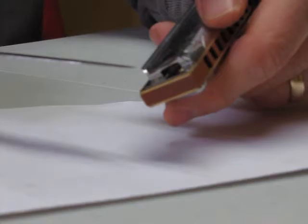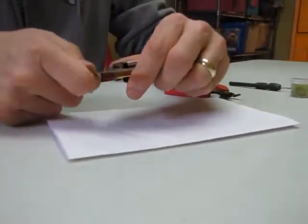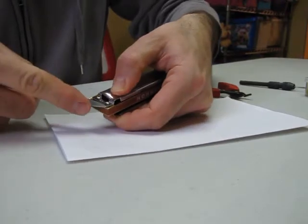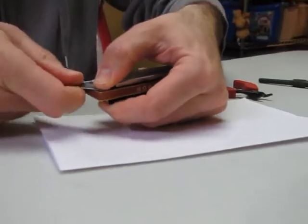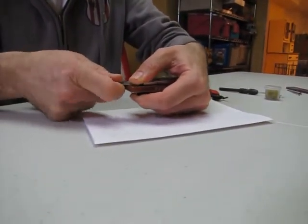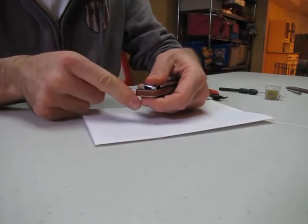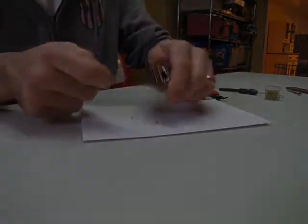We're going to take out the 8 nails holding the cover plates down. You just wedge this in and pry up on those nails. Push the cover plate down and the nails pop up. Then you can use the tip of this tool to pry up and remove the nails. That comes out fairly easily. You want to do this with every one. Some of them will be stubborn — I have an alternate method for you.